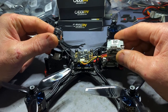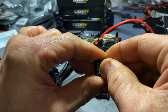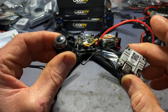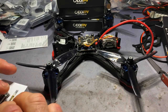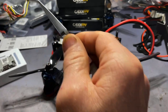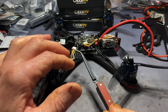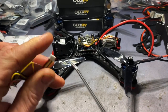The Vista's the same unit essentially - just cabling. We've got a micro-sized camera. Looks like it's got the same lens unit as the DJI Air unit. Same sort of style of lens. I'm looking forward to trying that - having tried the DJI camera, it'll be nice for some comparison. Same kit - Caddx antenna, a little JST lead. No differences with the Nebula Pro other than the camera. This is the JST plug I re-pinned for the header pin on the Fetec board. I just change the pin-outs by carefully lifting the tabs and re-pinning the wires. Not a problem.